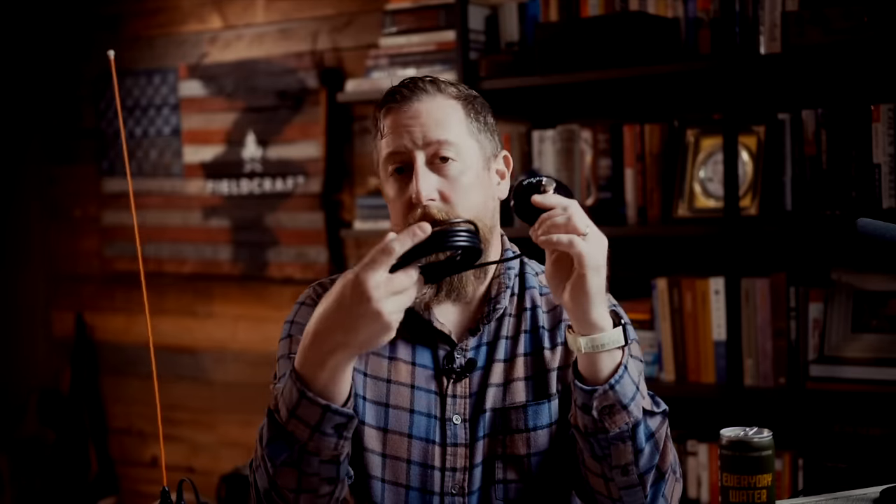If you're out in the field, the best thing to do is make sure you use your radio at the specified times so you're not burning your battery down. When you're in your car, have a solution for something portable — like a simple mag mount with a BNC connector — that allows you to take the antenna off, slap it onto the roof of the car, and use the coax to connect to the radio. It's a simple and inexpensive way to get communications on one platform without having to spend hundreds of dollars on a mobile radio plus a handheld.